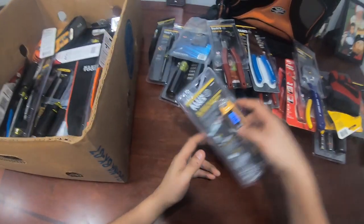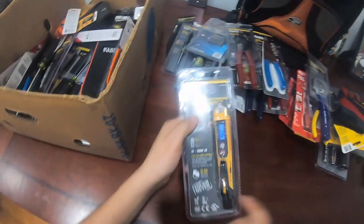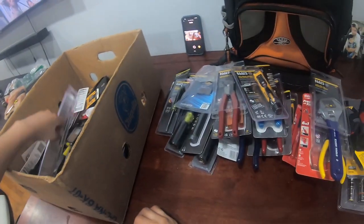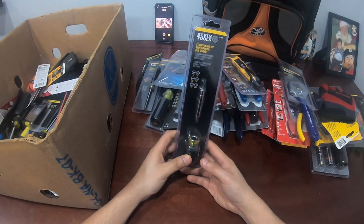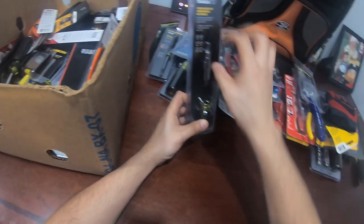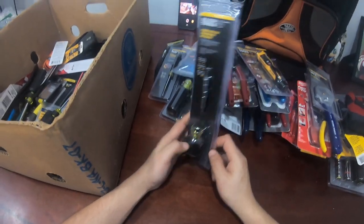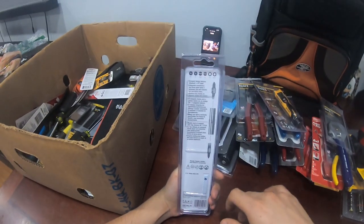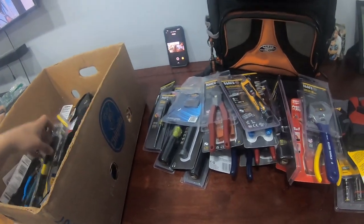This is my other non-contact voltage tester. This one has a temperature laser — it's reading 74.6 degrees right now. It reads from 12 to 1000 volts. Same thing for transformers: if you want to find the C wire, this will tell you which one is the hot, and by process of elimination the C wire is the other one. Stubby screwdriver — I love stubby. Sometimes when you've got a real tight tolerance or small space and you don't want to use the Z-tool, stubby will save the day. Mandatory.